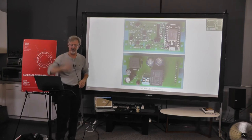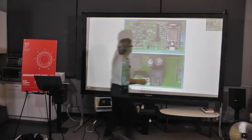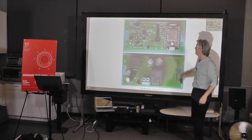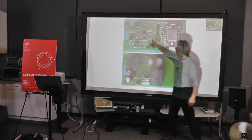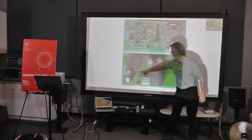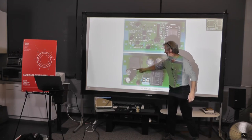This is the board that ended up — remarkably similar to what was in the 3D view. There's a Wi-Fi chip that connects very easily, a set of transistors to pull in a relay, a couple of LEDs, and there's the switch-mode power supply: 5V caps, pi inductor filter, transformer, and a MOSFET.